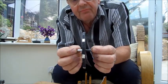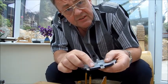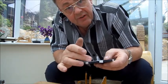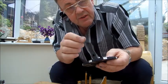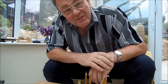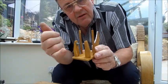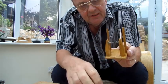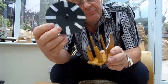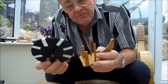It's a well-known fact that conductors such as this plate of aluminium here have electric charges in them, and those charges are evenly spread throughout the conductor. The only exception is when you have a very pointed shaped object — then the charges tend to accumulate around the tip of the point, rather as they do in a lightning conductor. That's the principle being used here, because in the stand there are two pointed conductors that line up precisely with the aluminium plates on either side. They don't touch it, but the aluminium plates pass between these two pointed conductors.